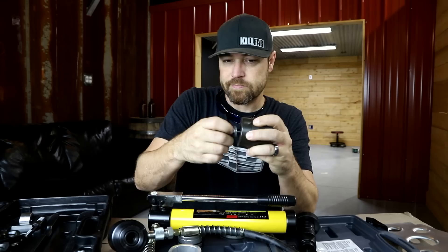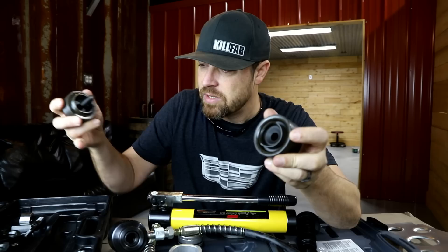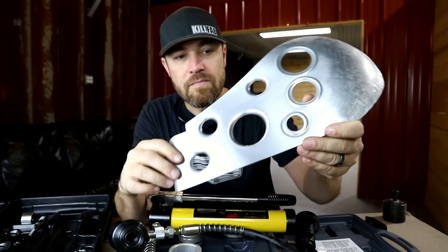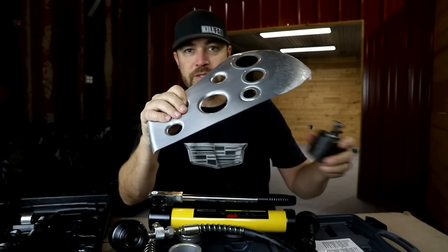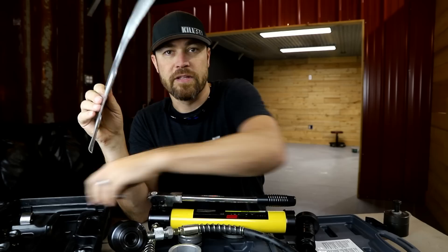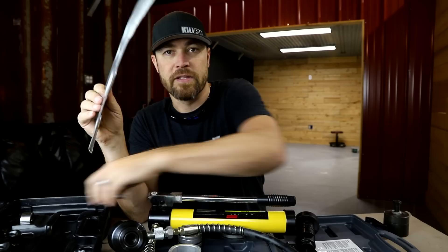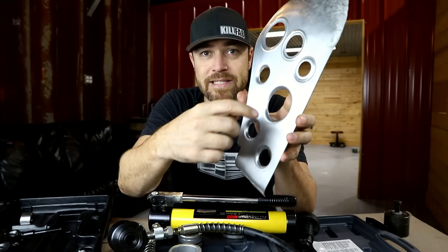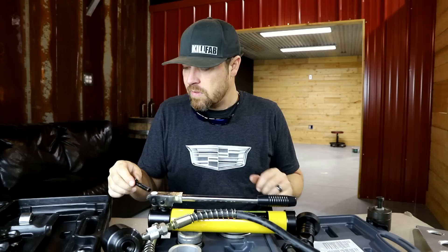Basically what this does is it has these little dies — you put them on here and it'll punch little holes in sheet metal. I actually use it for these punch and flare dies. These punch and flare dies work very similar to just the knockout punch, except that it'll put a flare or a bead in the panel itself. You can use this with the impact as well, just like everything else here. What I like to do is pair this with those — you drill the hole size for the adapter, which I think is like nine-sixteenths. Once you've got that hole centered where you want it, you put the die in there, attach this to the die, a couple of pumps, and the thing's going to punch a hole in it and either flare or put a bead in there for you. It kind of gives you that really cool look.